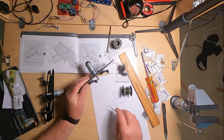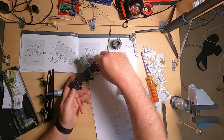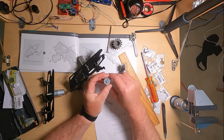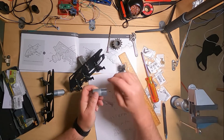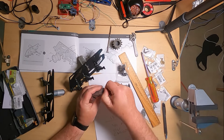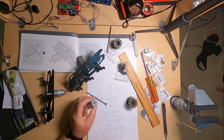The other change was I swapped the motors. These are the motors from my test bench that I was using for the other videos, and I want to use these because they've got encoders as well as being 12 volt motors. The motors that came with the kit were metal gear and quite nice, but they were six volts and didn't have encoders. So this looked like a good way to get encoders on there. I measured the mounting hole distances and the size and that all seemed the same, so I think we should be good using these.